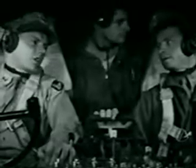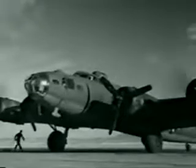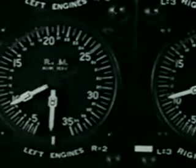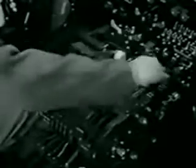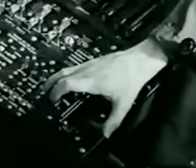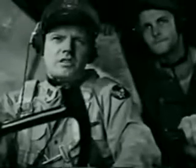Parking brakes? No, hold it until the chocks are in. If you set your brakes on hot drums, you'll bake the expander tubes. Don't turn off the ignition until the engines have stopped turning over. Alden Tower, this is 641. Mission complete.